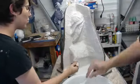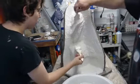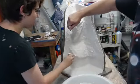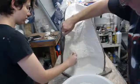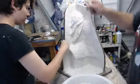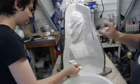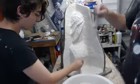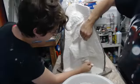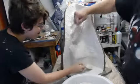You also don't have to be quite as concerned about it lifting off the master. Yep, you don't have to worry about this point so much on your mold walls because you've got enough mass on there to hold the mold walls in place. You're not going to push them over. You've got enough material on the detail of the piece that you're not going to mess up the details there. So you can be a little bit more aggressive. That doesn't mean hulk out and start smashing, but...